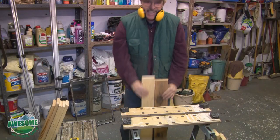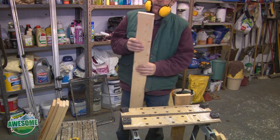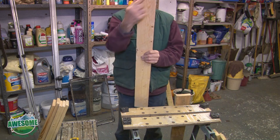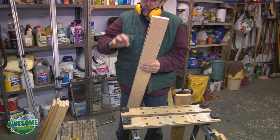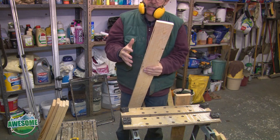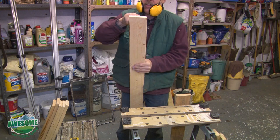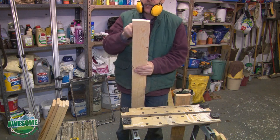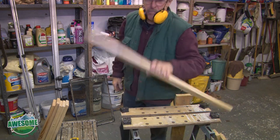Now, if you imagine this by two uprights, normally, ordinarily, with picket fences, they generally have a point, don't they? They have the tops angled off. You can also do it round, and of course it depends whether you want the gate to stand out as a feature. In other words, you have the picket fence with a point to them and the gate is rounded, or you want to cut all your picket fence rounded and match it with this. I'm going to do these as a rounded top, because this face is just squared like that. It's pretty boring, isn't it?